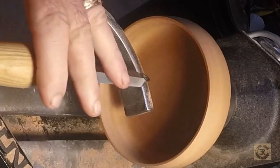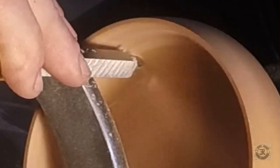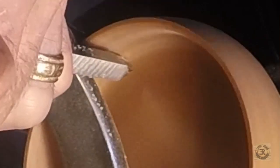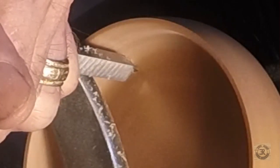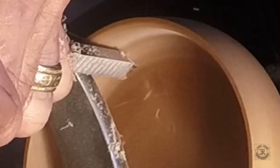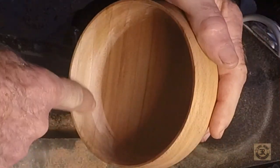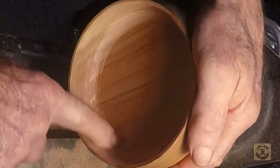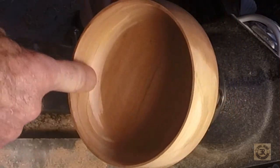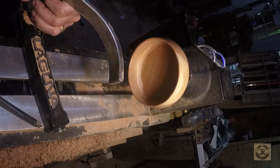1400. That chatter tells me what's happening. Okay, it's not perfectly round anymore. It's closing in. But that pretty much cures the problem if I can just get it down into here also. I'm going to put the rest just a little higher, so when I'm raising the handle I'm not getting too deep.